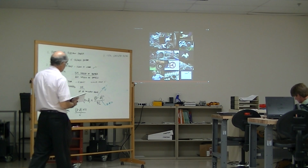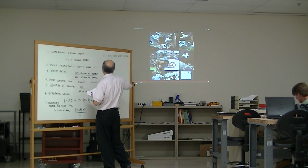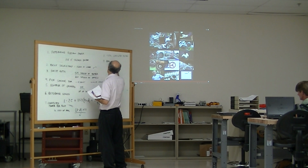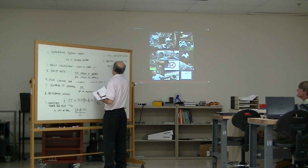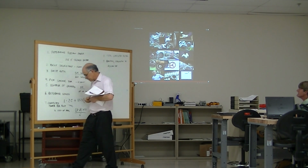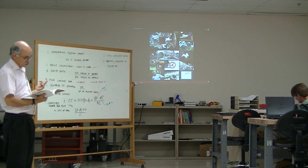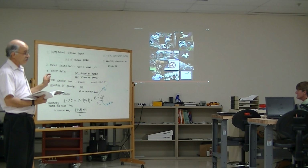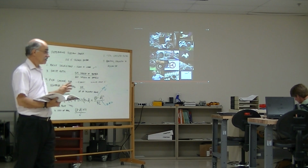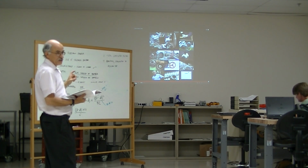And then, after all that, you compare the corrected total horsepower to the design horsepower. So you compare those two numbers. So remember we had that 6.5 before. And in this step you verify that the corrected total horsepower is greater than the design horsepower. If it's not, you got to redesign the drive using larger sheaves. So when you get to this point, this number is not bigger than the other number, it means that you haven't used big enough sheaves.